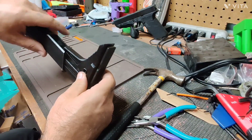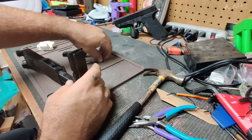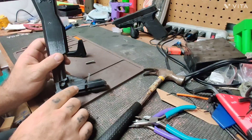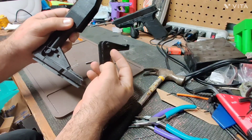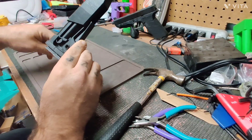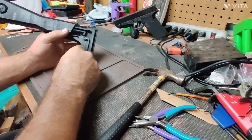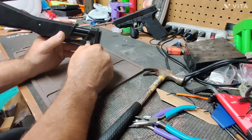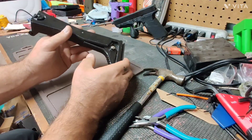This is your locking lever — this will lock your stock into the different positions. This part can be kind of frustrating because the spring likes to fall out. I've found that if you set the spring down in here first — there's a little recessed circular area up in here — you line it up, push down on top of it, then slide the Phillips head screw through there. That's not what the instructions call for, but it's what I had on hand and it lets me take it apart easily. If you get that too tight, the spring is not going to work.